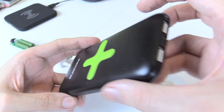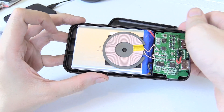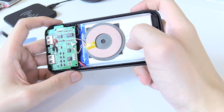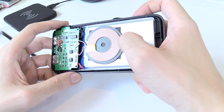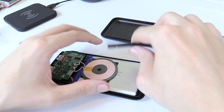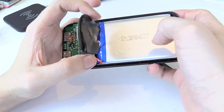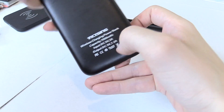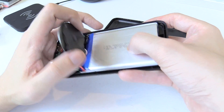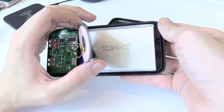I really want to open this up and check it out. It unclipped quite nicely, so it should go back together without issues. We've got the LiPo battery cell, the charging coil for wireless charging, and the circuit board. Looking under the coil to check the battery markings — it says 6,000 milliamp hour, but this is sold and marked as a 7,000 milliamp hour. So it's definitely not a true 7,000 mAh battery, and we don't even know if the 6,000 is accurate either.